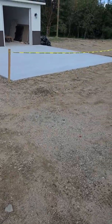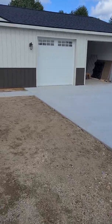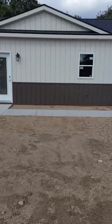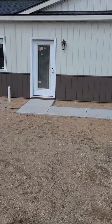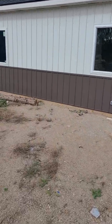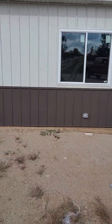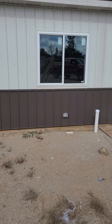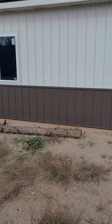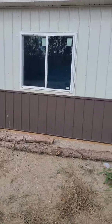So we got our exterior concrete placed last week, I think it was. Garage doors are installed. We got our trims installed below the doors and windows where our windows touch the belt line. We figured it was going to be best to keep a piece of trim in there instead of trying to tuck real small pieces of siding underneath the windows, and they're flashed in real good and proper.